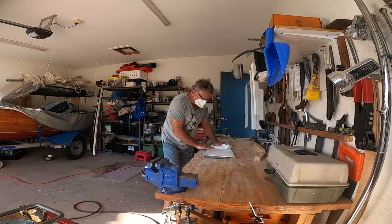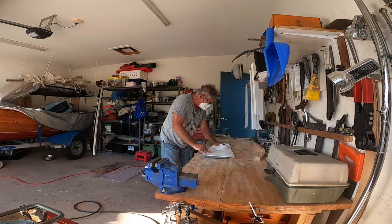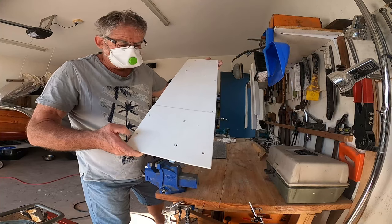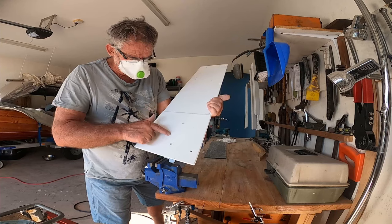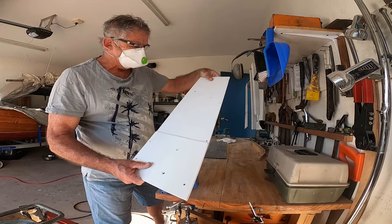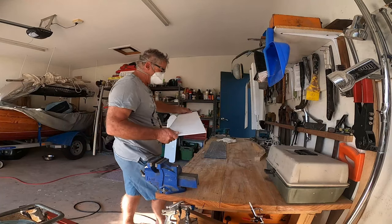These are the aluminium components, and there'll be some residual effect from where I previously rolled and tipped — I have cut that back. Hopefully you can see where I've cut it back with the primer showing through a little bit, just to take the brush strokes off. There'll be some residual brush strokes that may come through — it might not be perfect as if it had been sprayed from the beginning, but it won't be too bad.